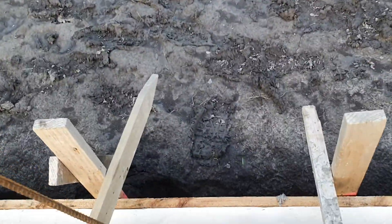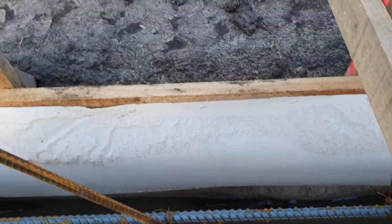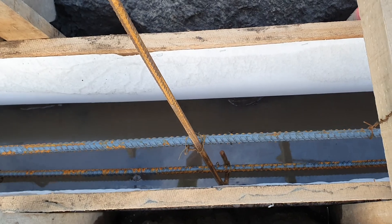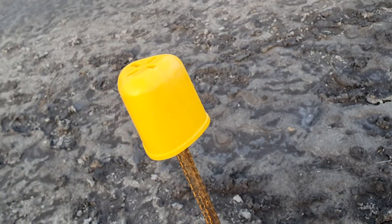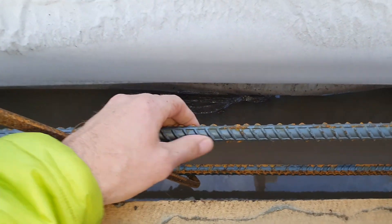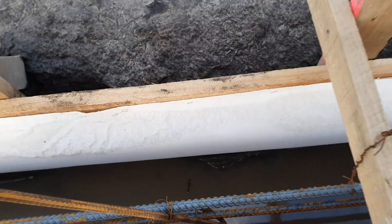Just a bit about the foundation. We've got some steel in here, standard 3604 foundation, two D16 rods. They form the concrete beam around the ring foundation. We've got the D10 starter rod. Nice cap on there, keep us all safe. You can see the ribs in here - that's the D, that stands for deformed. Deformed bar 16mm. Now that helps the concrete set around the foundation so that it doesn't slip.